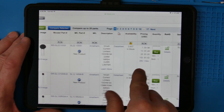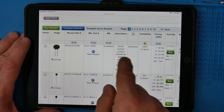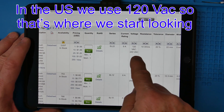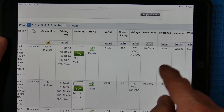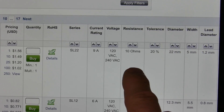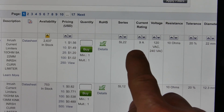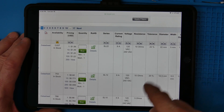Coming down here at these thermistors, you can see they almost look like a capacitor or an MOV if you're familiar with those. Over here there are voltage ratings — 120 volts, 240 volts — that's the kind of thing we want. 10 ohms sounds good. If we have 120 volts divided by 10 ohms, we have about 12 amps. That's the inrush current, so we're going to limit our inrush current to 12 amps. That will help our fuse and everything else. This 9 amp rating is the constant steady-state current, so we're well beneath that.